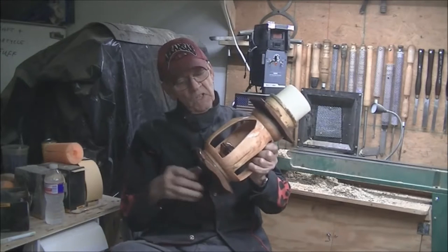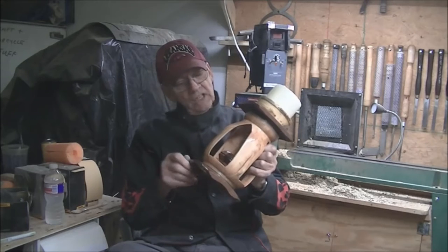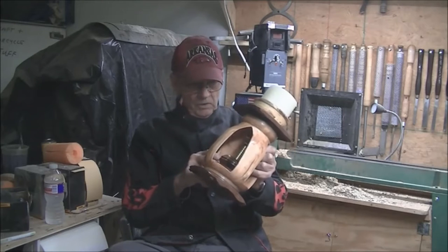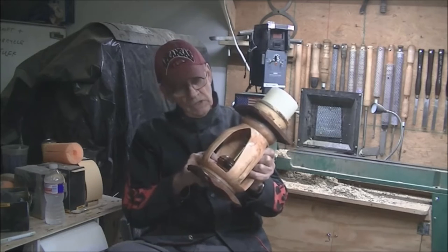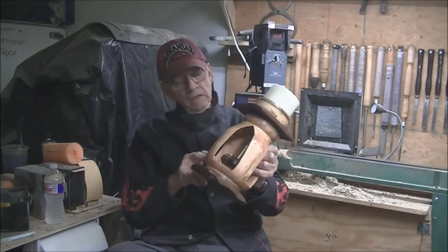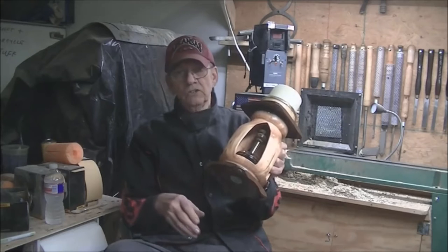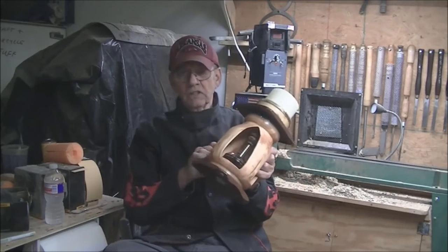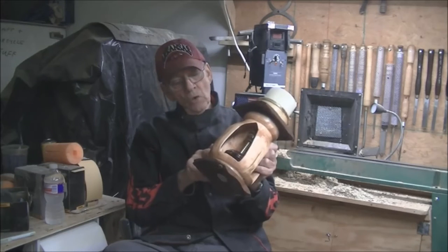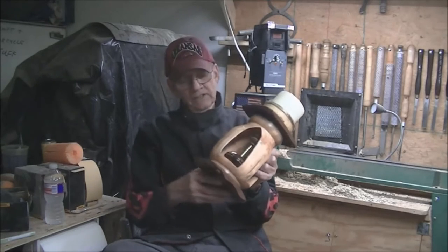The inside piece is made of several different woods. I made a mistake and did not film turning the inside. I filmed a video prepping it to turn it, but I didn't film turning it or inserting it inside. The way I inserted it was I had the blank turned inside out and in two halves. I set this in the middle and used thick super glue, CA glue, to hold it in place, then glued the two halves back together.